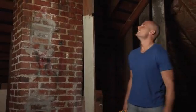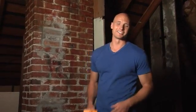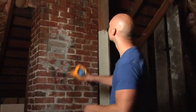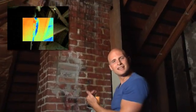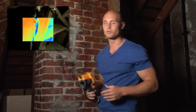Continuing to scan with water damage in mind, we're making our way up to the attic to check out the roof. Being in the Pacific Northwest, it's been raining here for the past few days, so any problems up here will be readily identifiable. And you see these dark spots? That's water that's come in through the roof, probably through misinstalled flashing, soaking these rafters. Over time, the water can come down the chimney, penetrating the ceiling below, causing real damage. And that's information any homeowner would pay to know.